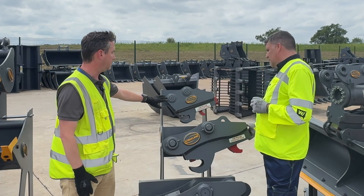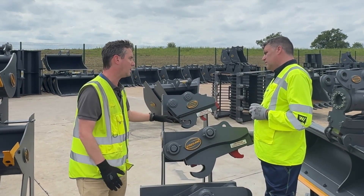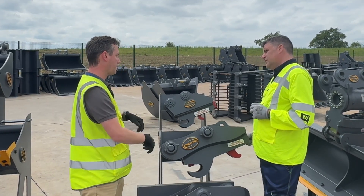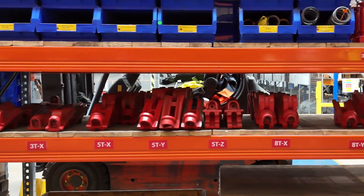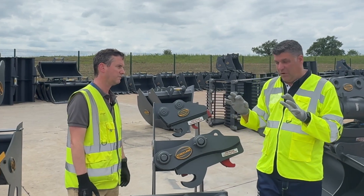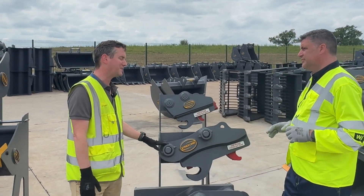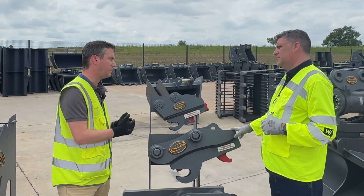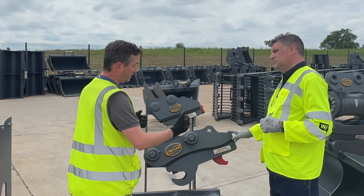Our 8-tonne-in-one. Now, on our three tonners and five tonners as well, it's versatile too, because you can change the hook — it's just one bolt. One bolt, change the hook. You can change the centres and the pin diameter. It's got to be simple. And the S Lock has the least amount of moving parts of any hydraulic coupler on the market today in the UK.